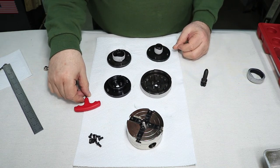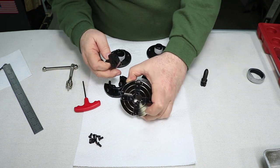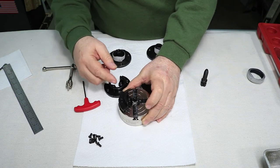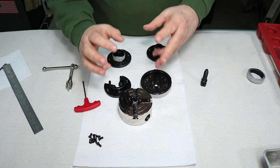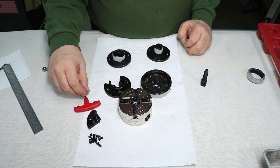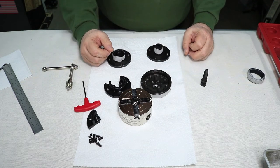Something I noticed is that when you put the jaws onto the chuck base, jaw number four has a pin in it that coordinates with a groove in the bottom of the jaw. This gives you the limits for maximum opening, which is a safety feature - you don't want to be on the last thread running at three or four thousand RPM barely hanging on. This way your jaws don't come apart on you, unlike some other jaws I have that lacked this feature.